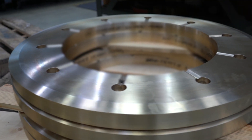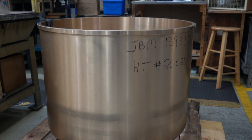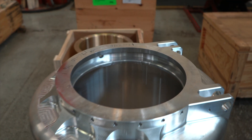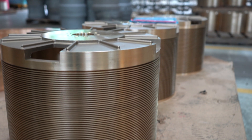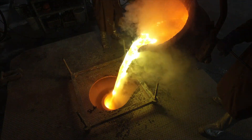What's really unique about our process is we make things that are round because the die is spinning. The ID will always be round, but we can change the die and add a flange, go into a square, or add a boss on a side. We can do all kinds of things built into the die — the metal flows in and freezes in that formation. Then we extract the part and are able to sell a completely seamless metal component.